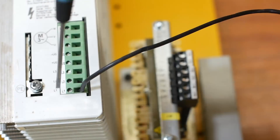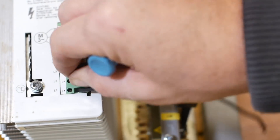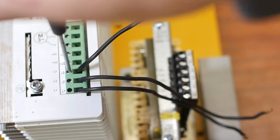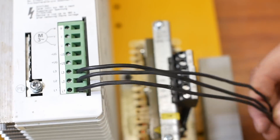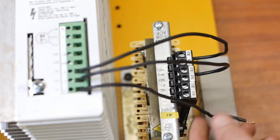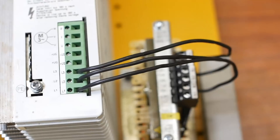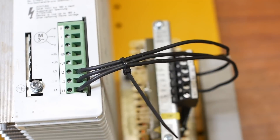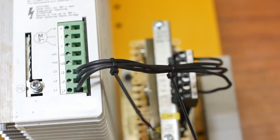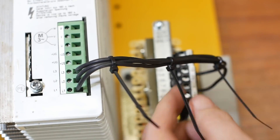When do you just use point to point wiring and when do you go out to a terminal block and back? It seems to me if it's just a one-to-one relationship it's better just to go straight from one to the other. Whereas with my main power supplies where I've got three phase coming in and having to split out individual phases, that makes more sense to take out to a terminal block. But if I'm doing this wrong please jump in and tell me how to do it correctly.